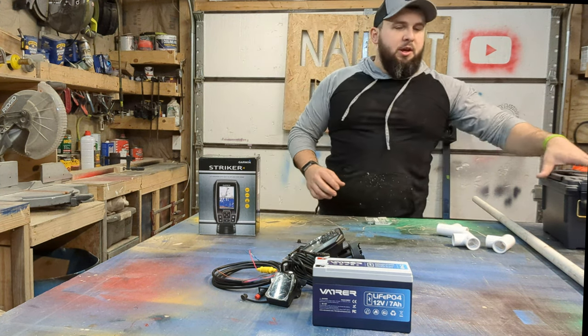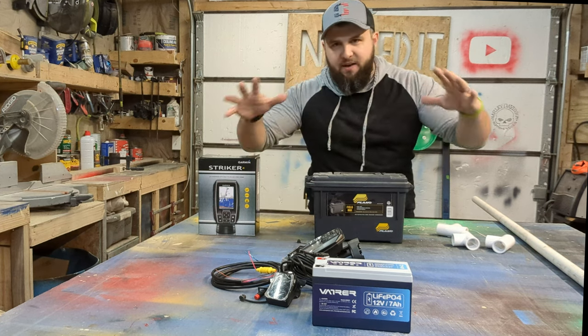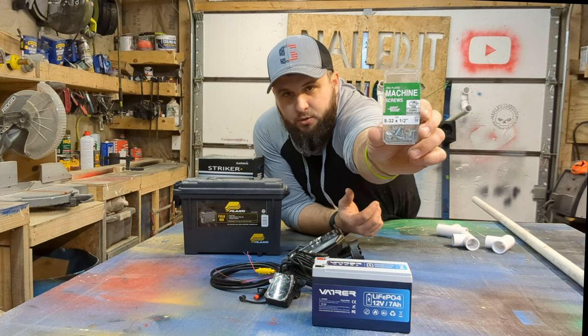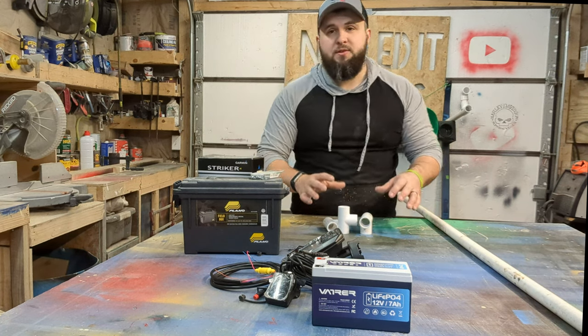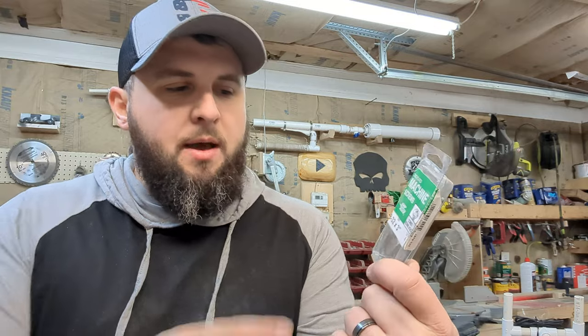You're going to need some kind of case or something to hold everything in, and that's where the ammo box comes in. I didn't want to go ammo box because everyone else does and I want to be different, but honestly it seems to be the easiest and best solution. You're going to attach the unit on top using 8-32 half-inch bolts. I also have three three-quarter-inch PVC tees and a section of three-quarter-inch PVC — you probably could go half-inch, but I just had the three-quarter laying around. You'll also need one 8-32 one-and-a-half-inch bolt and two small washers for attaching the transducer to the mount.